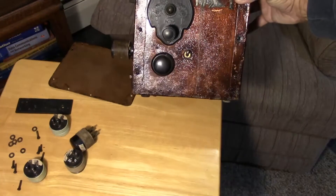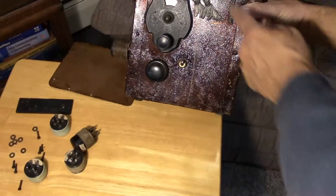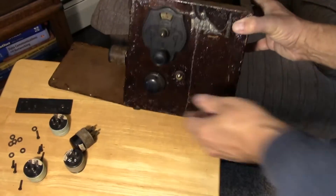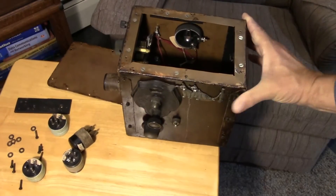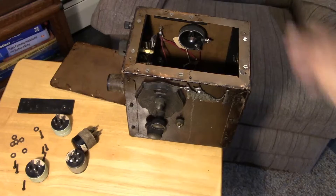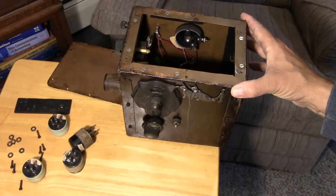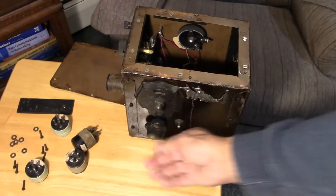There's a detail with Scotty dogs with a chain on the front, which tells you this was a ham operator and probably not a professionally built receiver. We've got the regen control, the band set, the main tuning, and the filament control in the back. This does not use a throttle capacitor for the regen control — I believe it's a regen pot. We'll see how that works.